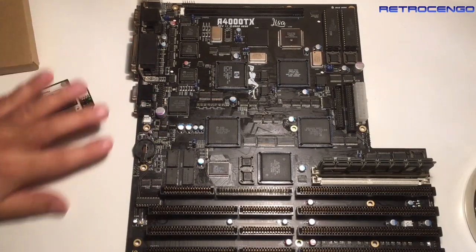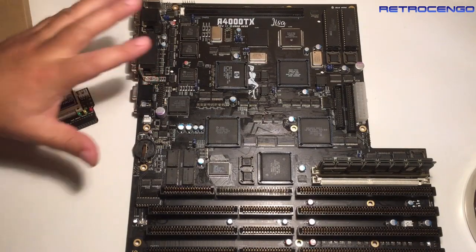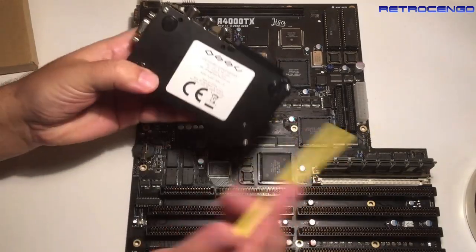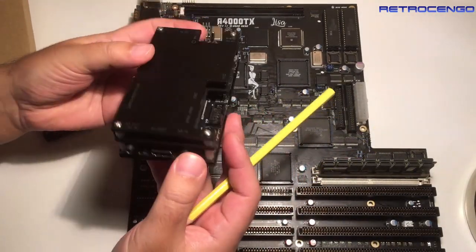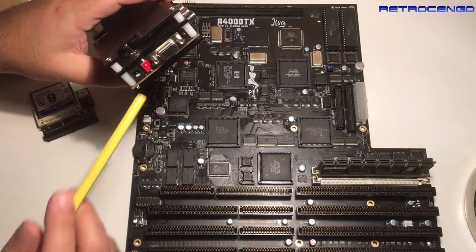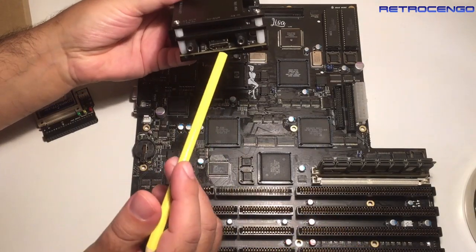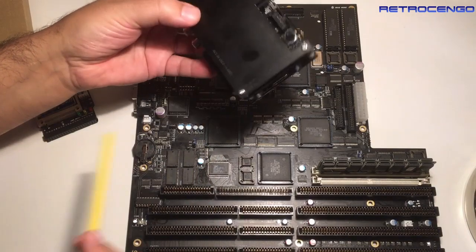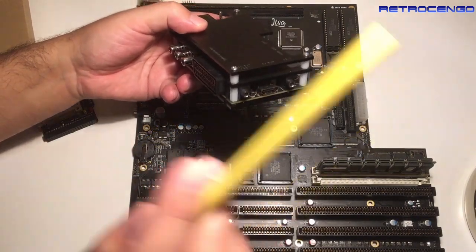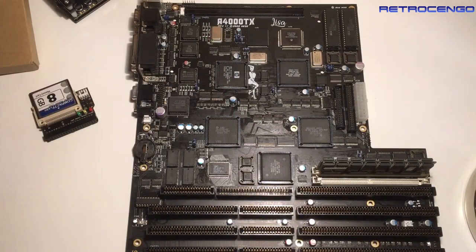So because of that, we're going to use the 15 kilohertz VGA out. I have a Dell monitor I have reviewed with a 15 kilohertz, and it looks so bad. So instead of that, I have got this OSCC device that we're going to use today. It is turned on. We're going to take a 15 kilohertz signal, put it in here. We're going to give it some power, and we have a nice display here. And on the other side, we will have HDMI digital video out. You can also use the RGB to SCART, put it in here, and from there have your digital video out. So we're gonna test this one also in this video, guys. That's about it.